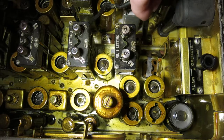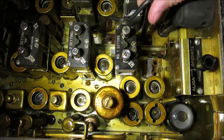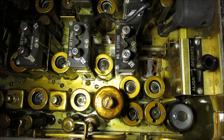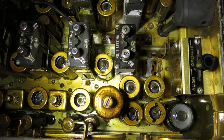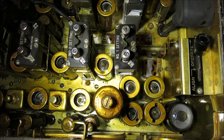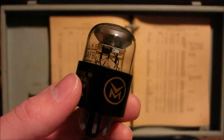When you turn the volume knob on, that energizes the radio and controls the 6AF6G tube. The volume knob controls sensitivity for the tube, giving different readings based on the variable resistor setting. To align the radio, turn the channel selector to A, pull out the little test prod provided — it has a wire attached — and insert it into pin 1. Then use the variable transformers along the side to tune for peak amplitude. You'll see the tube close up when peaked. For channel B, move the selector and prod to pin 2. When ready, set the transmitter switch to operate, and your radio is ready to transmit. Before talking, hold down the push-to-talk on the microphone and tune once more to confirm frequencies and crystal are good.